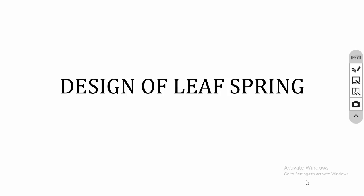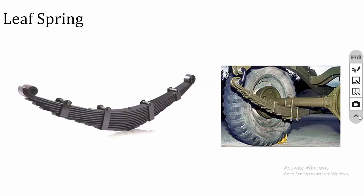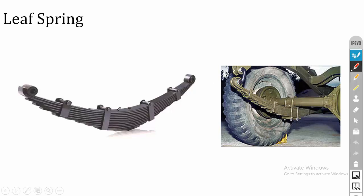In this lecture we are going to discuss the design of leaf spring. In heavy load carrying applications, leaf spring is used to absorb shock and vibration. In four-wheel trucks, the leaf spring is mostly used. The leaf spring is formed by combining many leaves of rectangular cross-section, held together by a clamping bolt. These leaf springs are initially in a curved shape so that when the load is applied it will deform and come to its flat position. This leaf spring is used for heavy load applications and is capable of carrying high loads.